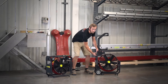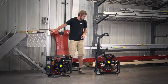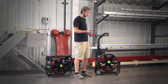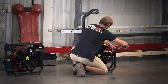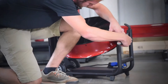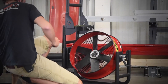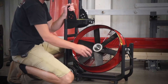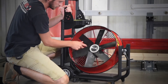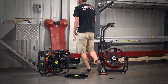Before doing that, make sure that all the power sources are removed from the fan so no accidental powering on can occur. For this you can use a power drill, a Phillips head, and pliers — to gain access to the blade. Once the front guard is off, this can be spun manually to find if there's interference on any single point on the shroud or possibly the rear guard. While you have this open, it's also best to clean the blade.